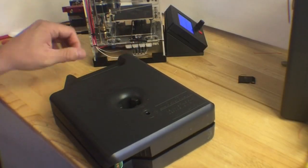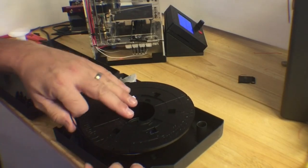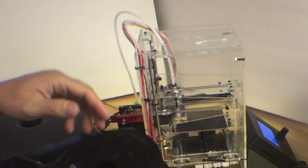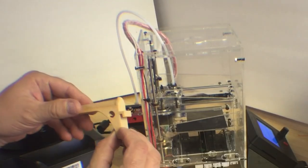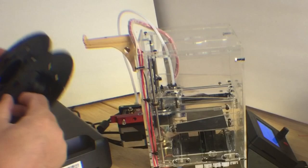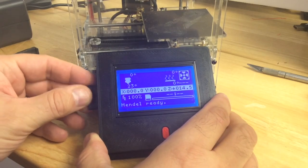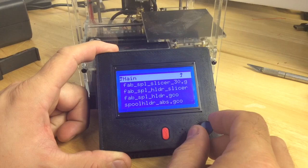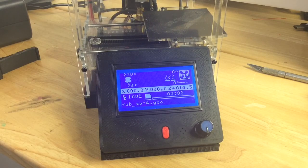Here's something interesting I found — I have a DaVinci cartridge that the DaVinci said had zero filament left, but this thing had like four or five meters left on its spool. So I can use this on the Fabricator Mini. It's ABS but I've got it printing ABS pretty well. I'm going to use this to print a new spool holder. The XYZ spools are smaller in size so they fit perfectly on the Fabricator Mini. I sliced it with Slicer, put it on the SD card as G-code, brought it into the LCD, clicked print from SD, selected the file called fab_spool_slicer_30, and the Fabricator Mini started printing.